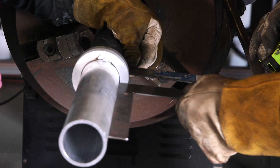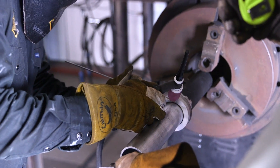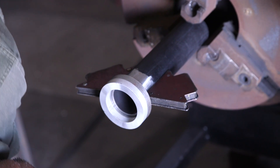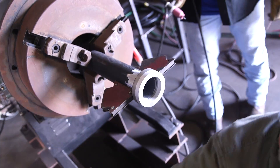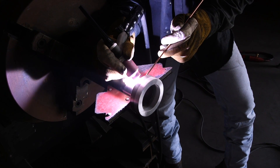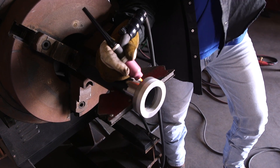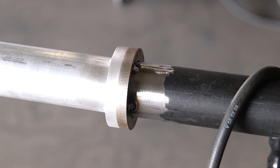After that, go ahead and put your tack at 12 o'clock, then six o'clock, three o'clock, nine o'clock, and get the other pipe — the carbon one. Like I said, measure three-eighths from the edge of the pipe, slide it up to the line, and make sure the metals aren't touching. After that, go ahead and tack it up the same way — 12 o'clock, six o'clock, three o'clock, nine o'clock. You can do this alone with some jack stands, or if you have fitter friends you can call them up, just like we do in plants or refineries. As you can see, we have the piece already tacked up right here and it's ready to be welded out.